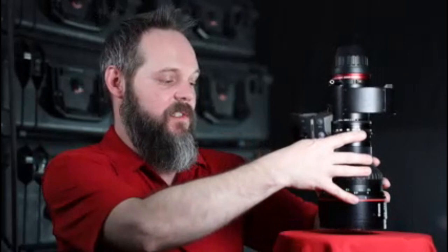There's actually a little dial right here on the back of the servo drive, and you set that all the way clockwise, and you're looking at half a second. If you take it down to the slowest setting, 300 seconds. Yeah, 5 minutes. That long State of the Union type of zoom where you don't even know that it's actually zooming in, you can definitely achieve that.